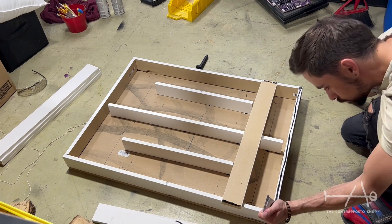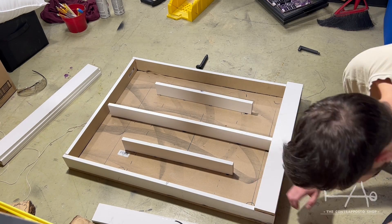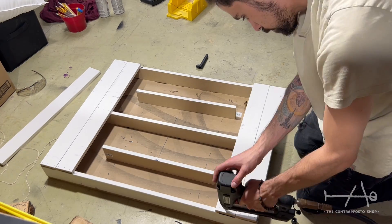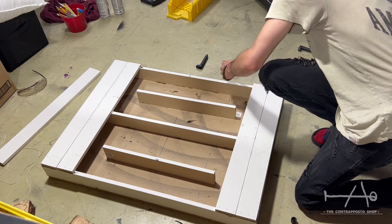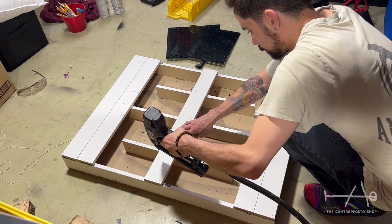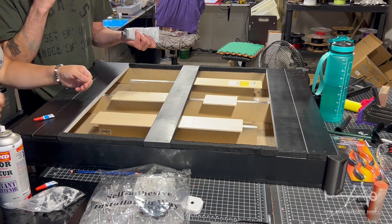The idea here is to have an air channel underneath because there will be a shop vac that sucks the air out to extract the fumes. We painted everything and printed corner pieces for the look. We then glued spacers to put metal pegboard on top — the holes let the air pass under the work area so the fumes can be extracted. On top of that, because it's made of metal, we can use a variety of magnetic tools to hold the project in place.